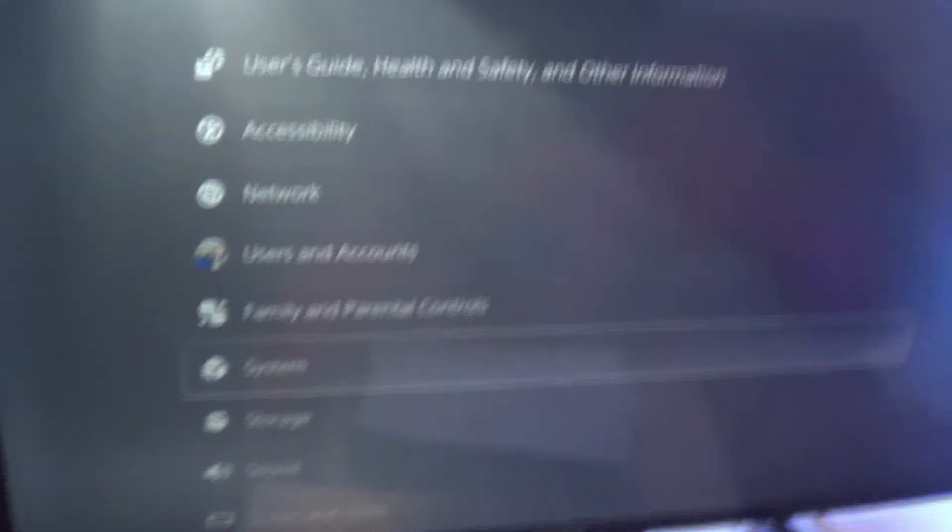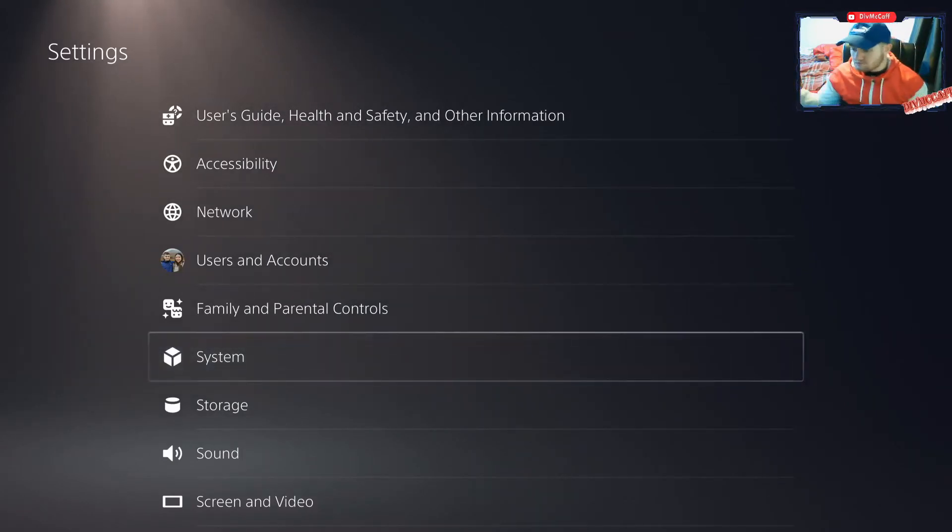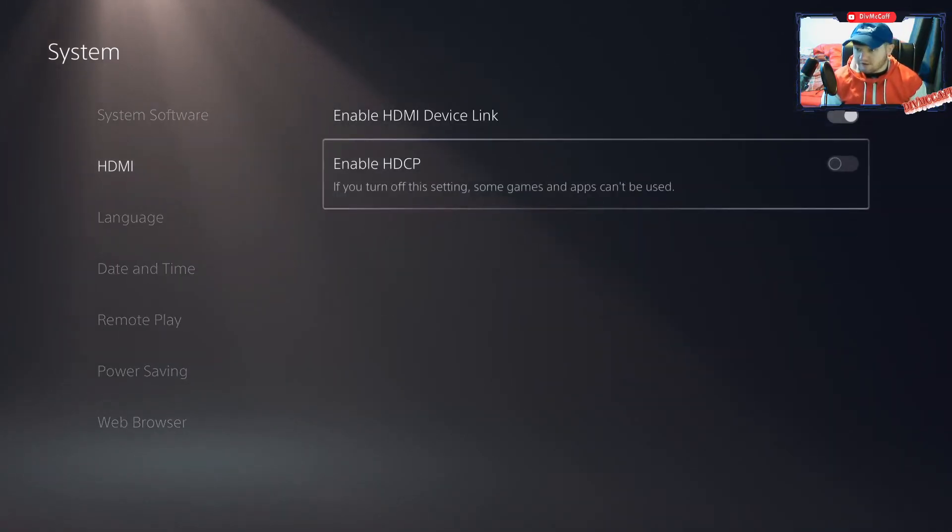That is essentially how to set it up. I know my accent is hard to understand — I've tried to be pretty clear. If you have any questions, because obviously my wires are a bit all over the place, leave a comment down below and I'll try to explain it as clearly as I can. The final part of the video — which I nearly forgot — is the settings for the recording. First things first: never forget to turn HDCP off. This needs to be turned off for the Elgato to work. It's basically Elgato's way of stopping people from recording Netflix or Disney Plus — prevents people from getting copyright struck.